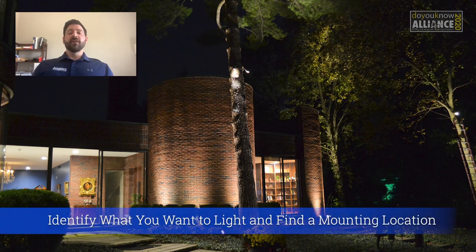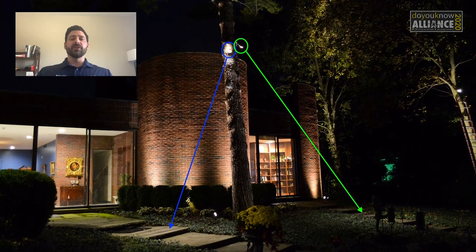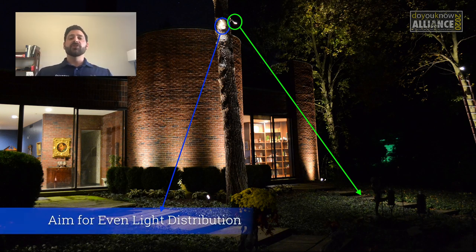So where do you start with downlighting? If you've identified an area that you'd like to downlight, the first thing to look at is whether there's a place to mount a downlight. In this example, we're looking at two trees with several downlights mounted on them to shine down on a walkway leading from the back of the house to a patio. As you can see by the ladder in the background, we're still adjusting these downlights. In the foreground, there's a tree with two of our DL200s mounted to it. We've circled these and drawn arrows to illustrate where these lights are pointed. The green downlight's path isn't quite as bright as the blue downlight because the green downlight is further from the object it's illuminating. Had we used our DL200BT fixtures, we could have used the dimming feature to even out the path and get them closer to the same brightness.